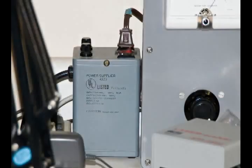If you are planning on working on older electronic devices such as radios, old stereo equipment, tape recorders, all kinds of audio gear and test gear, you need to get an isolation transformer. It is not just a nice thing to have. It is a must thing to have for safety. I use my isolation transformer 100% of the time.